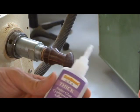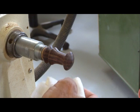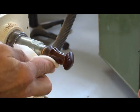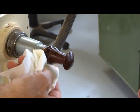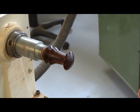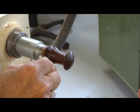The finish that I apply on my bottle stoppers is CA glue and Handy Bond. This is a thick glue because it dries slowly. I put the glue on the end of a paper towel and apply it to the wood evenly. You haven't got a whole lot of time to work on this because the glue dries pretty fast. Then let it set. After the glue is set, I buff it off a little bit with Scotch-Brite.